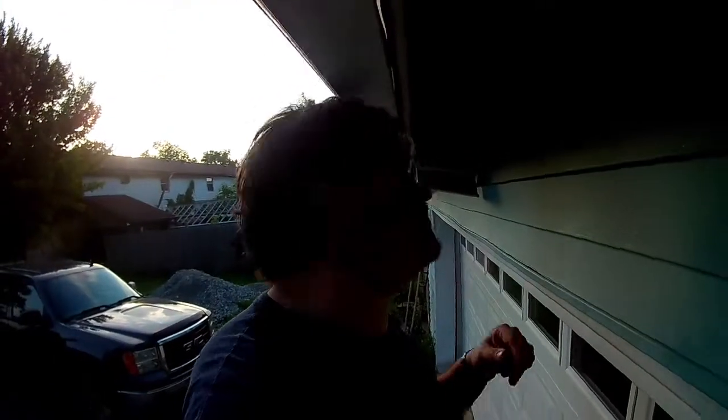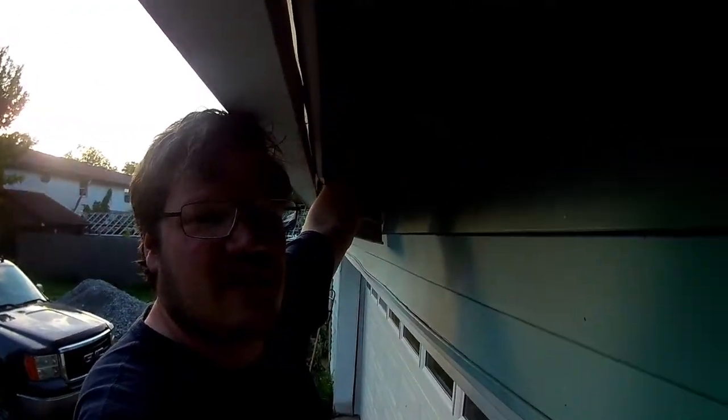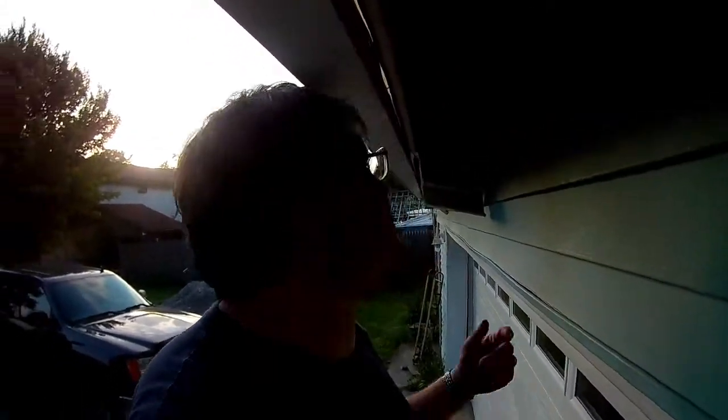This one was loose. I already secured it before I decided to make the video, because as you all know, all I ever do is work and fix up around my old houses. So again, just take it, shake it, see if it's loose. If it's loose, all we have to do is drop down the gutter, pull it off and shoot a couple of 3-inch screws into the rafter tails. You may need to sister a board up here onto the rafter, because sometimes the ends of these rafters like to rot off, or you can possibly use a 4-inch screw to get some good meat. So all right, I'm gonna go ahead and put this piece up. Got it ready to go.